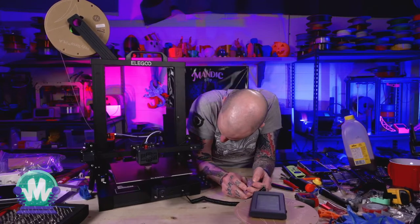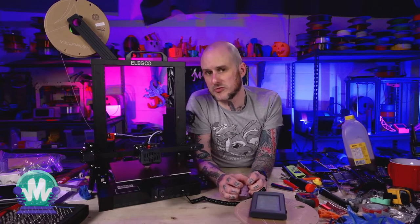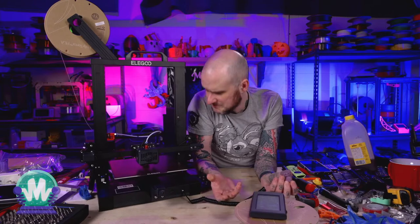I mean, under extruding on infill for sure. We're back to under extruding on infill, so 170 is pushing it over the flow rate of the nozzle, or the hot end. Not a big deal there.